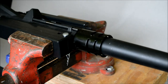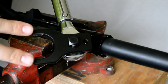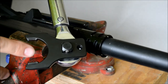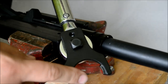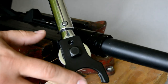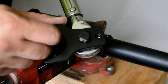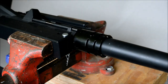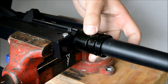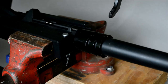A lesser known common mistake — when it comes to torquing these down, when you have your torque wrench, you actually do want to put your attachment at 90 degrees. The reason being, if you have it rotated straight, this increases the distance from the torquing mechanism down at the handle, making the effective length longer, so the torque measurement is actually off. When you have it at 90 degrees, you get the accurate torquing measurement. Also, per the instructions, you want to put the wrench on the second notch — not the furthest one out, but the second one. If you put it on the outer one it'll damage it, so be aware of that.